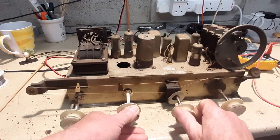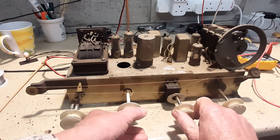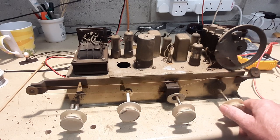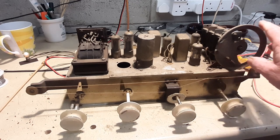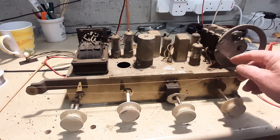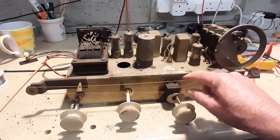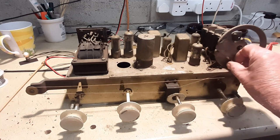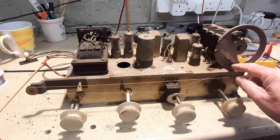Longwave, which I would expect to be the most useful with our local station here, is completely quiet. However, this gives me some hope that we can get this thing going again. The next thing to do is to recap — replace the capacitors in the chassis — because most of them are waxy capacitors that are normally dead, leaky, or just gone out of value over such a long period. Don't forget, this is from the 1950s, so it's nearly 70 years old. I also need to re-tension the string on the dial drive, as the pointers are in the wrong position and the string is very loose.